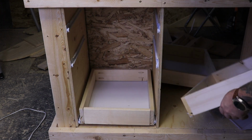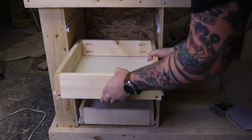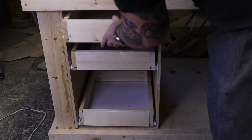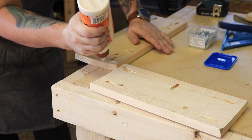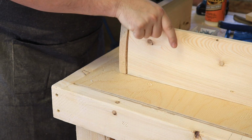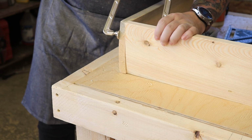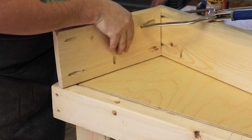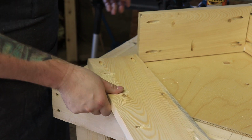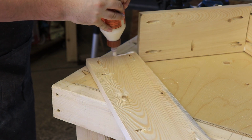There, now this worked out much better. Originally the middle one, the rails weren't even touching, so this worked out really good. As you can see here, I have room for another drawer, but I only pre-built 3 of them. And I wanted the bottom drawer to be nice and deep. So what I did was I cut out some pieces of wood in the same dimension that the drawers already were, and then I just placed that on top so it could have a deeper drawer.